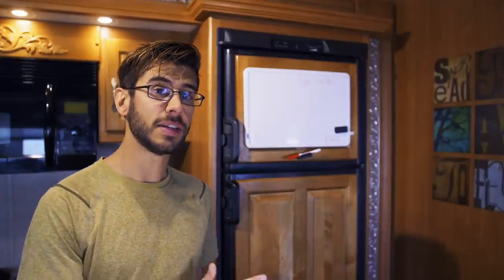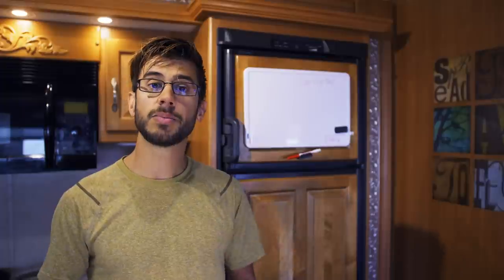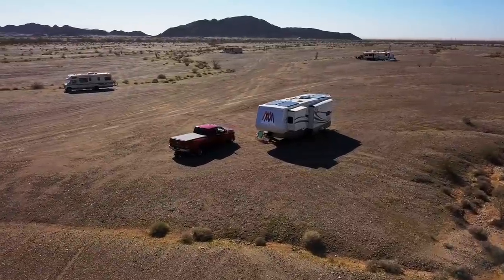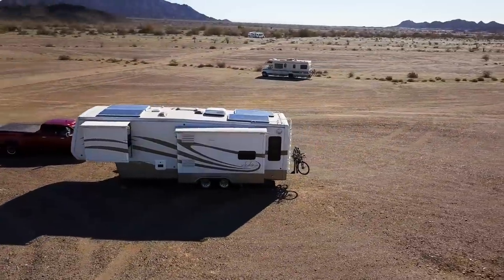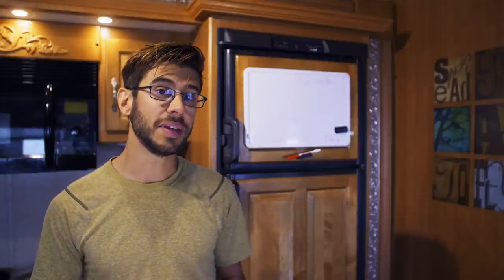The second most common question is how much power does it actually use. In the previous video we talked about power efficiency as a big reason we chose this route. Compared to the previous absorption cycle running on propane, this fridge uses a lot more power. The absorption cycle uses almost zero power, but because we have a considerable solar system — about 1200 watts — we wanted to power our refrigerator from the sun. Over the past six months this fridge averages around 400 to 800 watt hours of power usage per day. I've seen it as high as around 1.2 kilowatt hours, but that was when temperatures were well above 90 degrees. Outside temperature swings definitely change the power consumption considerably.